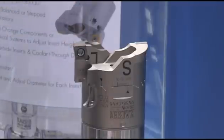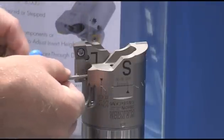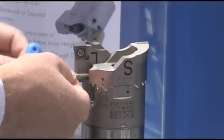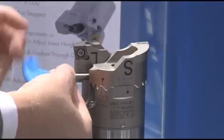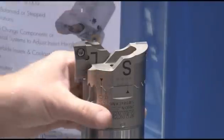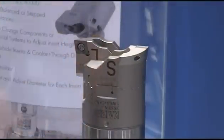The tools are very easy to adjust from one side. One screw and wrench is fitted in and will move the diameter in one direction as well as the opposite direction, so presetting is very simple. It even comes with a metric scale so that the user can define the diameter directly on the side of the tool and preset it offline without the need of a presetter.